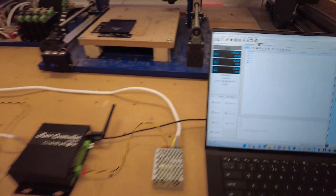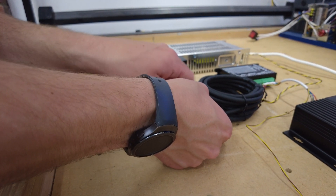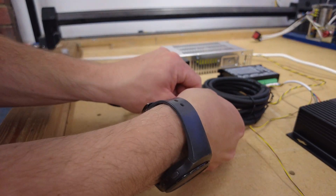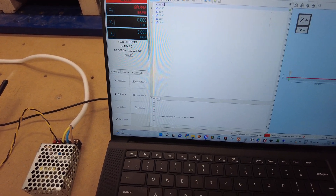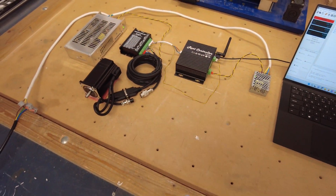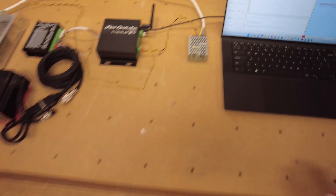So let's do something you're not supposed to do but do it anyway — let's disconnect the stepper motor. Let's say there was a fault in the wiring and it broke. If I head back to the PC and press play, it goes straight into an alarm state. Didn't even try to do anything — straight into an alarm, halted the program. You can come and investigate what's going on. Alarm — perfect.